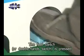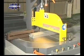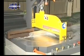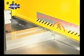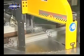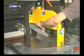When the foot switch or double hand switch is pressed, the machine will perform material clamping, cutting, and spraying lubricating oil automatically. The built-in saw blade raises up to cut the material and also allows cutting with single or several materials simultaneously and safely.